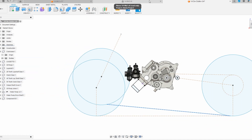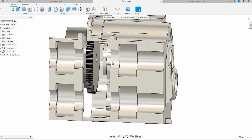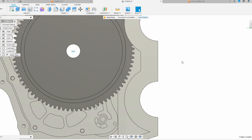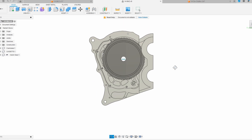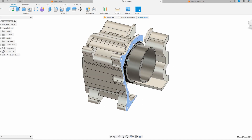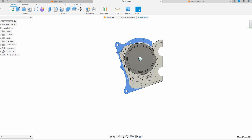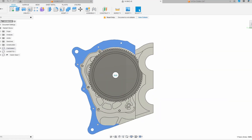So I backtracked and came up with Mark 2. I didn't get very far because I gave up on it, but here was my idea: coupling gears directly driving the clutch, coupled here with the gear driving the clutch. The pain in the ass thing would be assembly — this interfering with this means I'd need to install the clutch without a needle roller bearing on the input shaft. It looked weak with a huge open area, but it was a hell of a lot smaller — just look at the clutch versus the clutch.